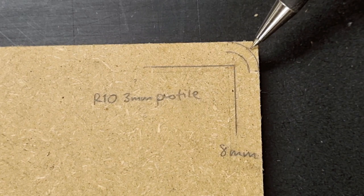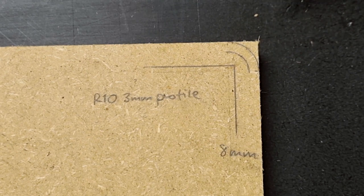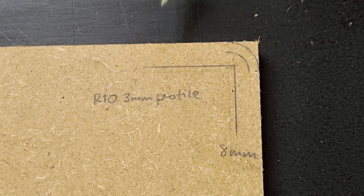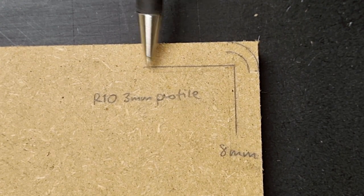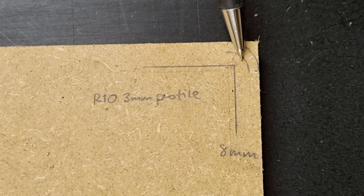For this project I will have a 10 millimeter outer radius, and then the edge profile will eat up another 3 millimeters, leaving me at this line here. I drew two lines for an intended edge banding thickness of 8 millimeters, which gives me some margin to the inner line. Eight millimeters would be good enough, but I will go for a slightly thicker 10 millimeters — it's easier to keep track of the numbers and a thicker edge banding is less flimsy to work with.